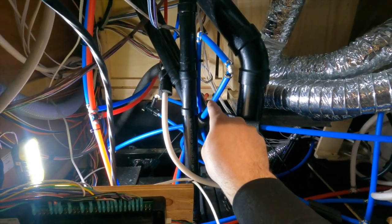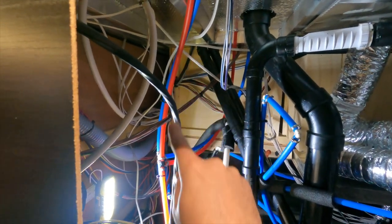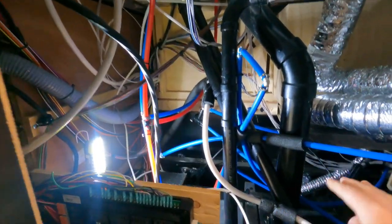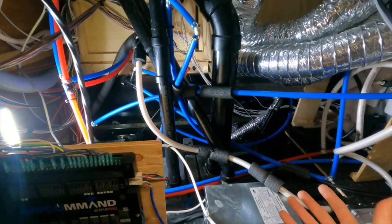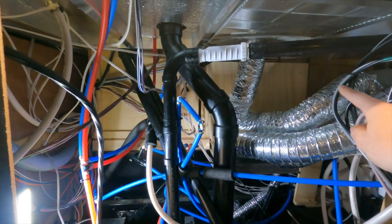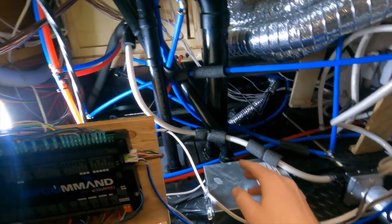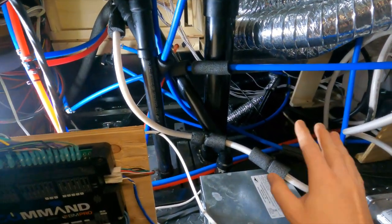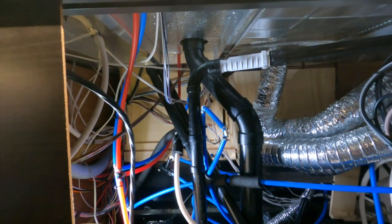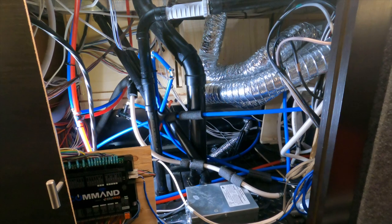All that is really down lower where it could potentially be a little bit cooler. Heat rises, and so I'd rather have vulnerable things that could freeze up here closer to the living space, as opposed to down here where it could get a little bit cooler. So that's another goal — to get these water lines as many of them as I can up here along the ceiling on the floor deck above, so that they're perhaps a little bit warmer in the cooler months.